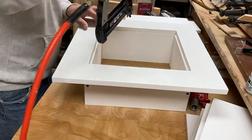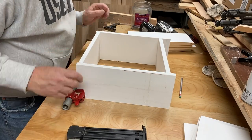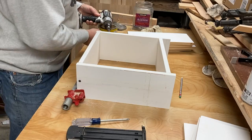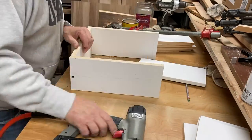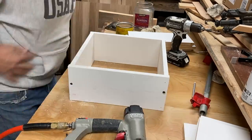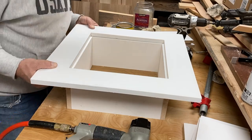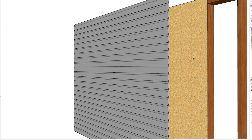I drilled out the countersinks and then drove the screws in with a screwdriver. I clamped each one to get the screw in just to hold the box together, then lined things up so everything was square, plumb, and flush, and shot some 2-inch brads in top and bottom on each panel. They made for very rigid panels. Before applying the face frames I checked them for square and was careful to nail the face frames without splitting out.